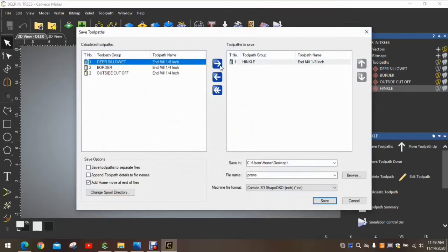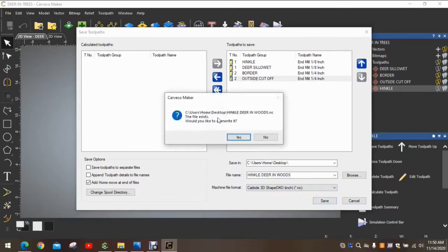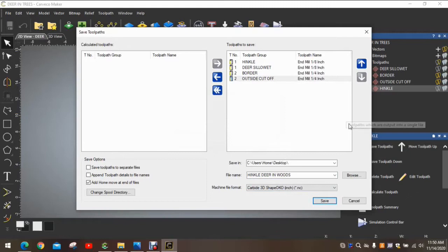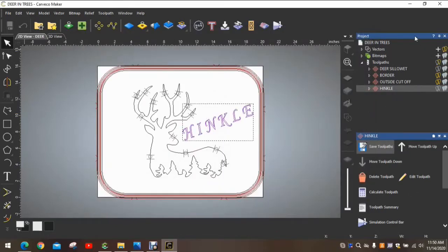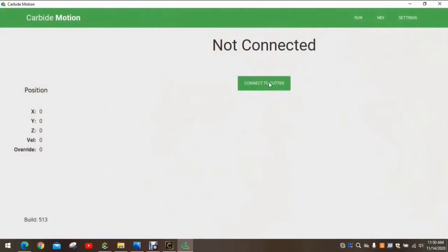Now I'm going to go to Save Tool Paths, and with this arrow that I'm clicking here, it sends the tool path over into the working section. Now I'm checking to see that the tools are in the proper order. On the bottom here, we enter a name for the tool path, this total job, and we will save the tool path once I get done typing with one finger, because I'm a hunt and peck type typer, not a whole-handed typer. We'll save that. Do I want to override it? Yes, I do. A lot of times I'll click that twice and say yes, I want to override again, just as an insurance policy. We'll open up Carbide Motion, connect to the cutter,